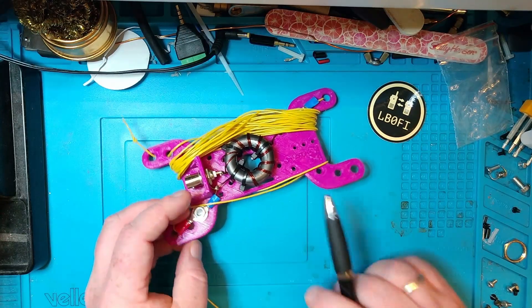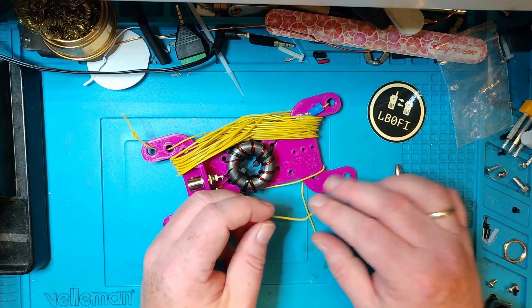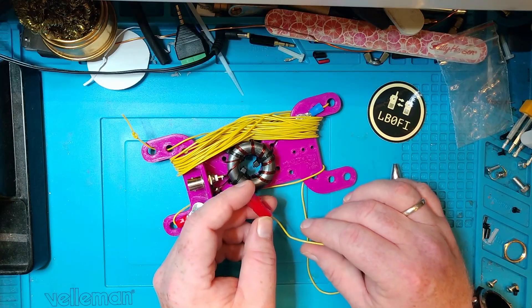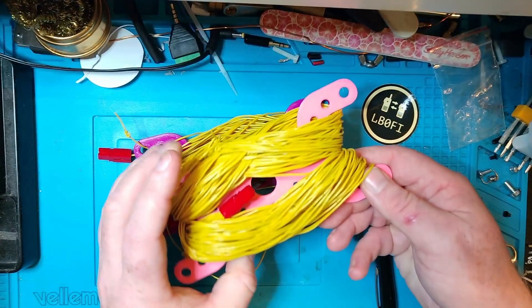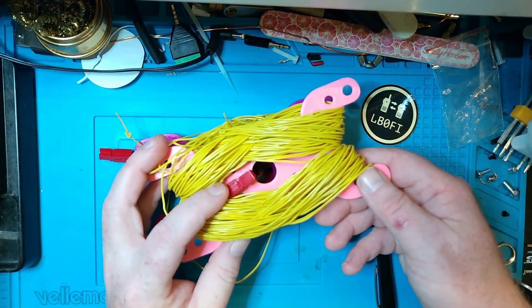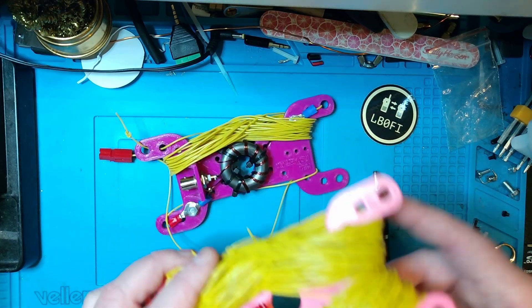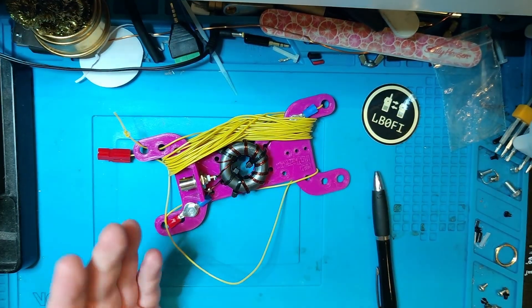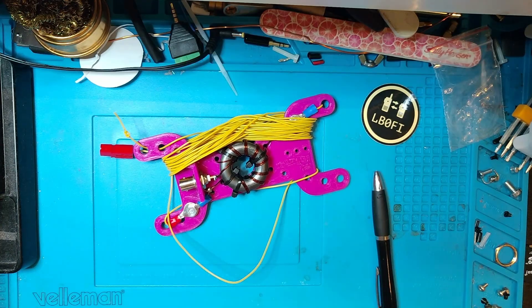So this is connected both to the ground side of the BNC and the radial net connector. For the radial net connector, I've done like I usually do on my antennas — I use power poles. That's just a short piece of wire with a power pole connector. Then I can hook up this radial net here, also with a power pole connector, which I use for all my antennas that require a counterpoise net, so I can use this one for a variety of different antennas.